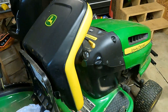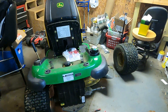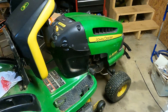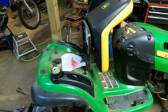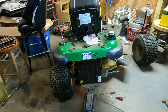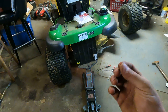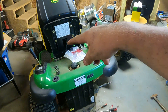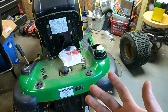Here's the issue I've been having. This mower only has 300 hours on it and it stopped pulling when it got hot. I thought the belt must be stretched — getting hot and getting loose. But there's no squeal, no sound, and the belt's not slipping when it gets hot. So I started researching these hydrostatic transmissions and put my hand up under and touched the transmission when it got to the point where it wouldn't pull anymore. The thing was so hot I couldn't touch it. I know there's a fan that spins on top that cools the block and keeps the oil cool inside that transmission.